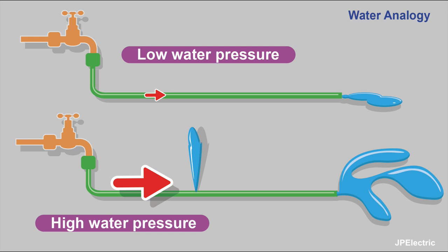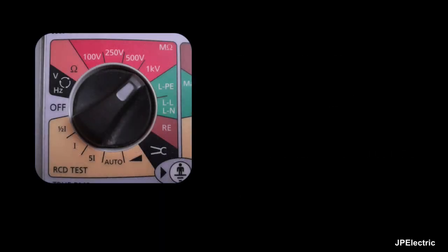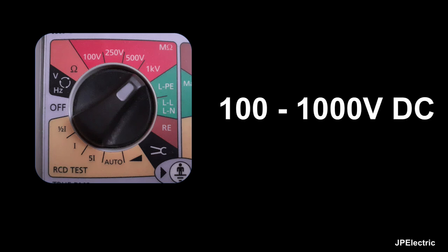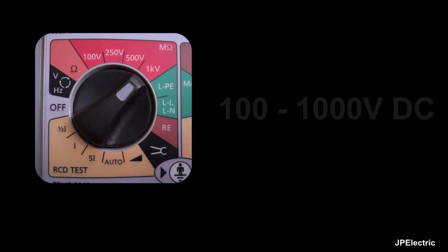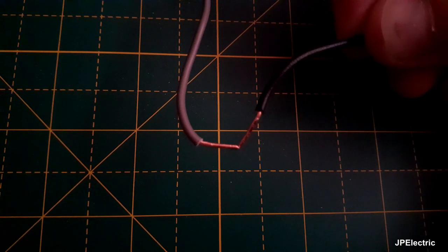All insulators pass a little bit of current, and if the voltage is great enough, the more likelihood that current is going to flow. We use a battery-powered insulation resistance tester to create this high voltage, but with a very limited current — we're not using mains voltage to test with. This is the voltage selector on my meter, and it goes from 100 volts to 1000 volts. Generally we would test at 500 volts. If you put it on the 1000-volt setting, you'll get a little warning. The actual current is limited to milliamps, but you can still get a shock from it, so you need to take care.